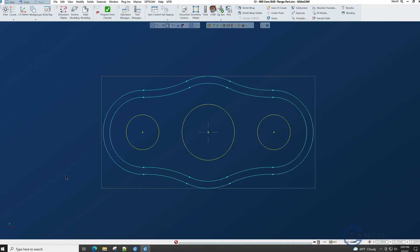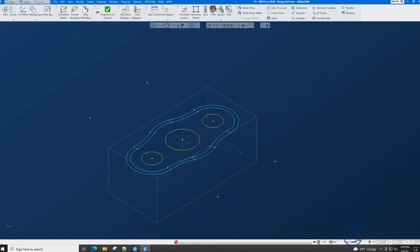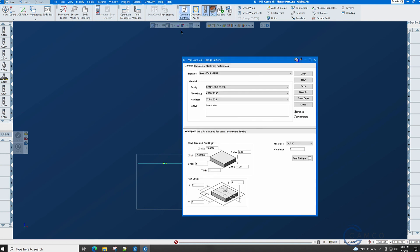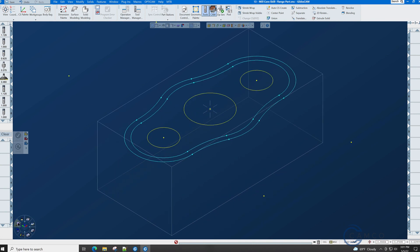It's now time to start machining. Let's go to isometric view and no zoom — notice that there are a few construction points out in the air that GibbsCAM used to create these arcs. Let's go to Tools and CAM and throw away all of the operations that we have here because we're going to start from scratch. The first thing we need to do is determine how much material needs to be faced off the top of the part. In Front View, this gray box is the stock, which comes from document control — we have a quarter of an inch of extra stock on the top that we need to face off. Back to isometric view and no zoom. No zoom fits the drawing to your screen; you can also use Control U on your keyboard.